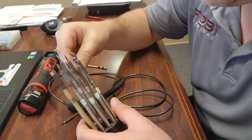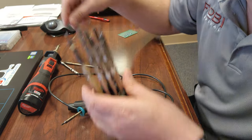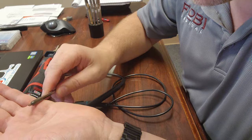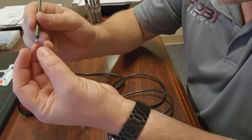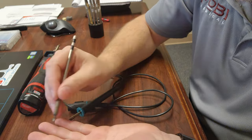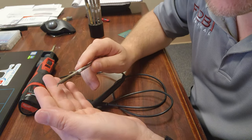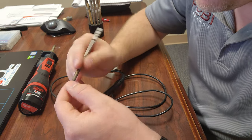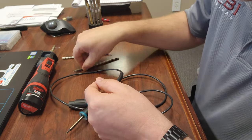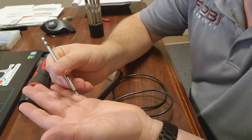You really don't need all these tips. What I normally use is the small chisel, and also I like this guy — this is a three millimeter oval. This is one of my favorites because when you touch solder, the solder ball likes to collect right on that flat area. So the solder sits right here on the tip, which means you can transfer over connections way easier. Conical tips, no matter how good they are, solder just does not normally like to sit on them. There's not a lot of thermal mass, so it's really easy to sink the heat away from really fine tips, whereas this oval or wedge style just seems to work really well.